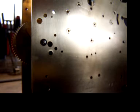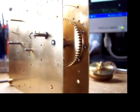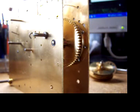And then I put the thing together after the Loctite had set, but the problem was that the front bearing didn't want to turn as well as the rear bearing. So then I thought what I would do is on the front here, on the pivot, I would go ahead and stipple it just a little bit, just a couple little punch marks. It didn't work. The front bearing was actually turning a lot slower than the rear bearing, even with the pivot gripping it. I don't understand why.